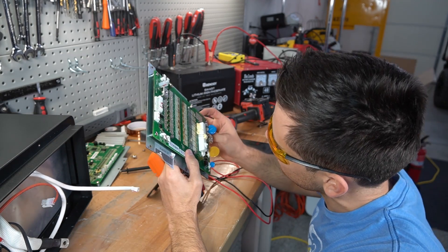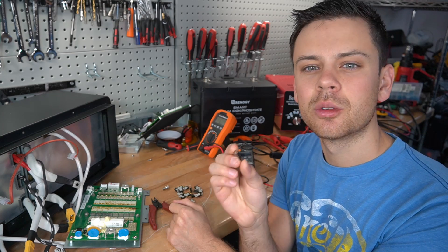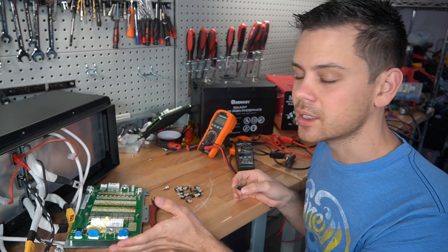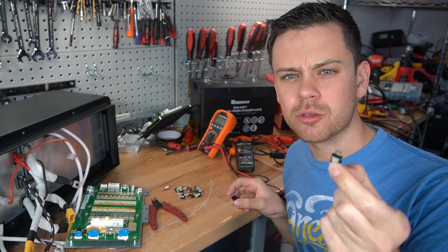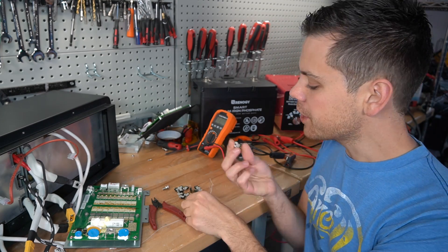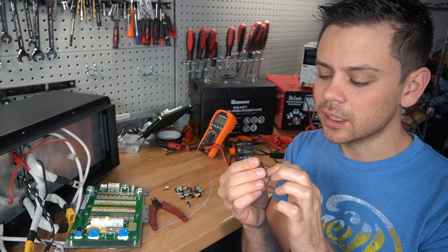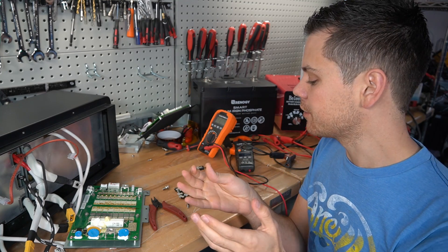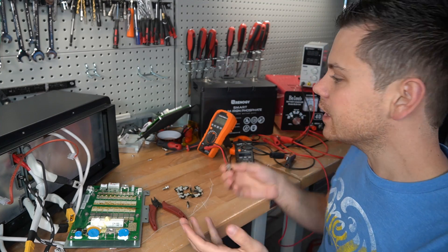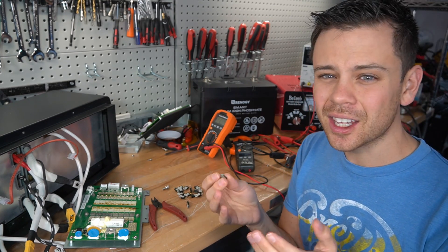These capacitors look great too, considering they were exposed to high voltage. I also found a failed FET — between the source and the drain there was zero resistance, but the resistance values between the source and drain on all the other FETs varied quite significantly between 60 and 200 ohms. I read my electronics repair manual and it didn't really have a protocol for testing these, and I did touch them — static discharge can destroy them. But this one was handling the current of the entire battery. I know that because there's a dead short and it overheated the lacquer on the legs, and there's discoloration on the back when none of the other FETs had it. Going by my manuals, the thing that kills FETs most is obviously high current and high voltage, so I'm guessing it is still the charger. We didn't do any high current testing — I did 0.2C rate for the discharge test — so I don't think it could have been anything else.